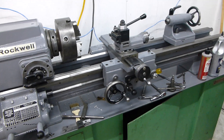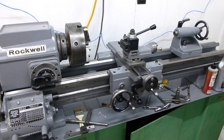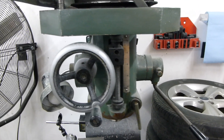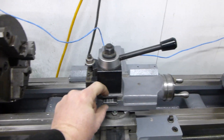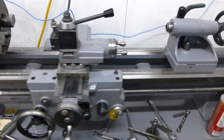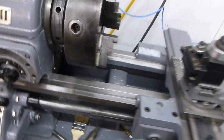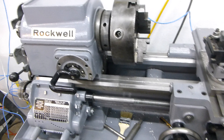I'm already starting to think that I might want to replace my mill at some point in the next few years — get a bigger, more sturdy mill. The spindle in this thing seems to be a little chattery; I'm thinking maybe it needs new bearings. It was really giving me some trouble yesterday when I was making a few parts — I had to make a new shoe for the compound and a spacer to bring it up above this level so that the quick change can rotate. I'd like to get dedicated square drive wrenches for all the places that need them, and I need a chuck key for the four-jaw. That seems like kind of a fun thing to make.